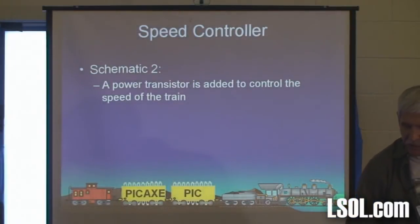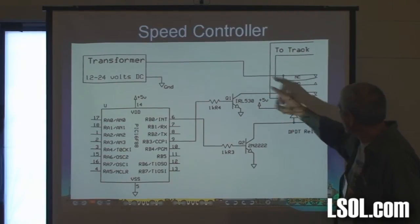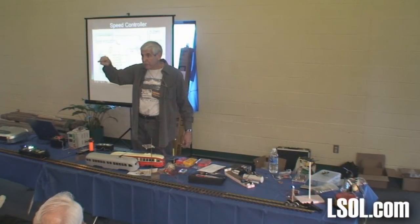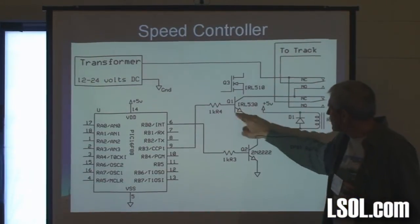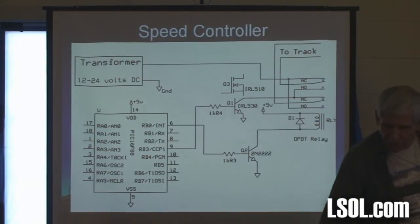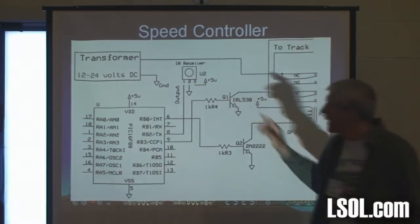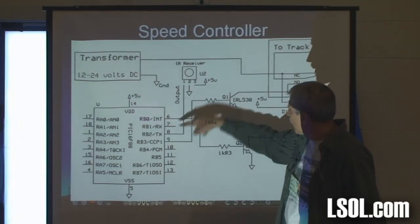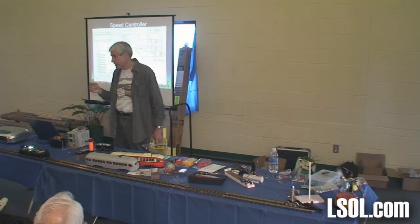Second schematic: we're going to add a power transistor to control the speed of the train. We've cut the power that normally goes in from the power supply and put in a big transistor — this is a transistor that has a big metal tab on top so it can handle more power. The symbol for a regular transistor versus a MOSFET — they do the exact same thing and work the exact same way. And finally we add one more part: the infrared receiver. That's all it takes — give it five volts, connect it to the negative part of the power supply, and the output goes to a pin on the Pickaxe. The Pickaxe knows how to talk to it already; you don't have to program it.